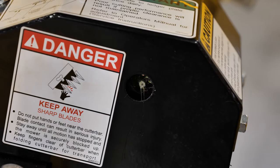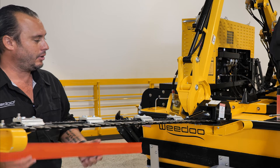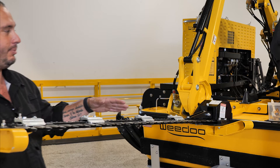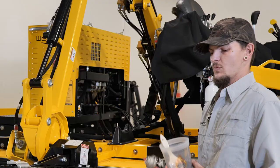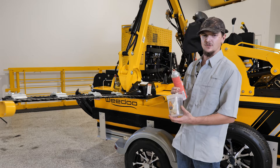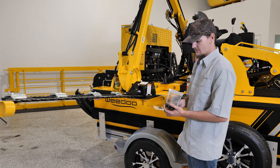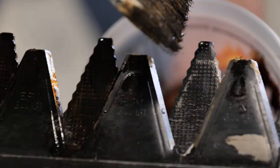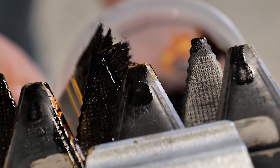And that's how you grease your cutter. Another part of the cutter that needs to be lubricated is the blades. We removed the sheath and we have a special lubricant — it's basically an open gear and wire rope chain lube. It's really messy stuff, so we wouldn't recommend just spraying it all over the place. The way we like to do this is using just a paint cup or a small plastic container, and a clean paint brush. Most open gear lube is pretty thick, so you're just going to put the cup right underneath and grease right in between the blades of your cutter. Make sure you get underneath also, because it does travel over beneath the fixed portion of the blades.